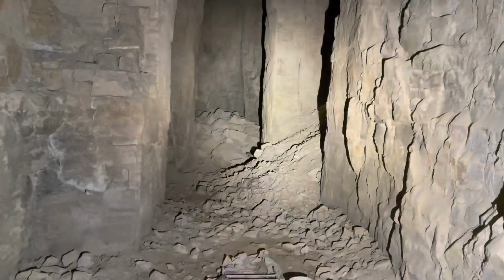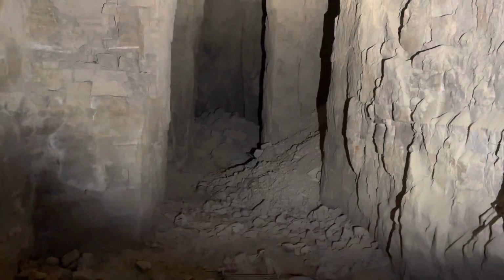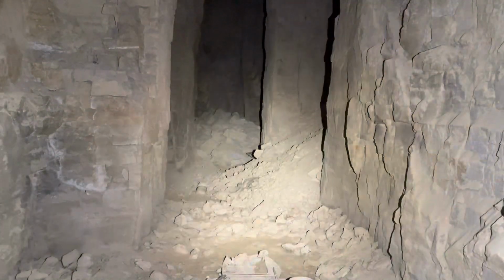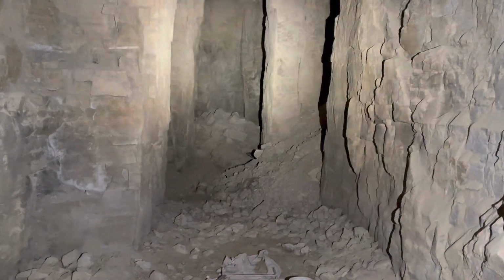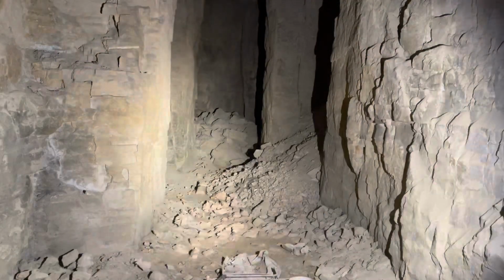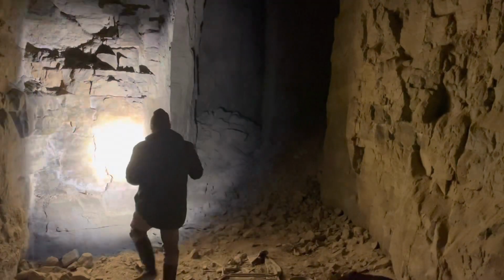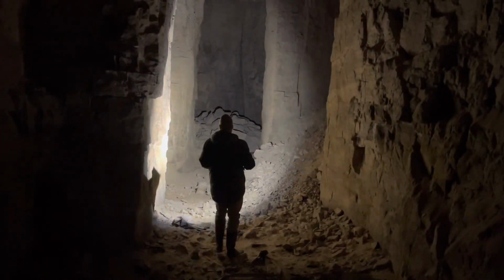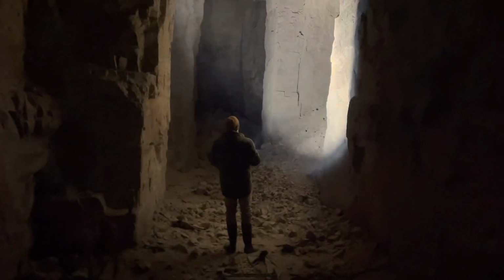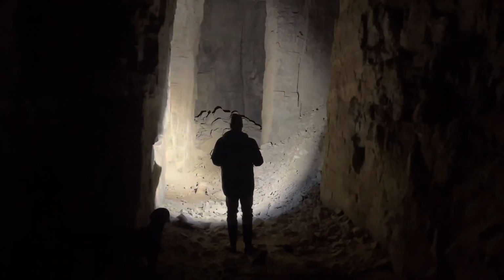We are now in the 1900 lumen mode. As they indicated, I measured 1812. As you can see, it's a really nice beam. We have some decent beam distance, but also a nice side spill. They say that it will run for 2 minutes in the highest mode, and then it will dim down to about 800 lumen, and it will continue for 110 minutes in that mode. I measured 700 lumen, and then after 110 minutes it will dim down to around 230 lumen. I measured 200 lumen, and it will continue for another hour in that mode.